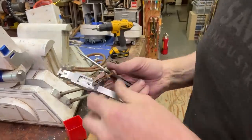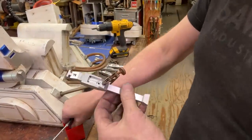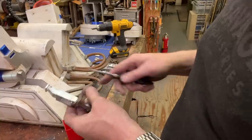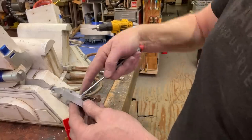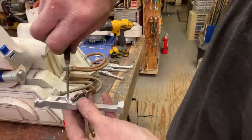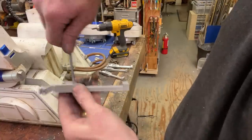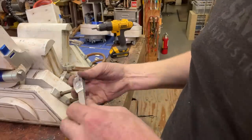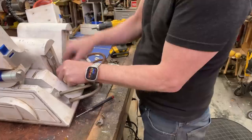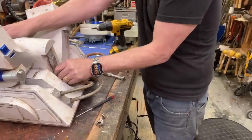Last one, I'm just gonna show you what I'm doing here. So I clamped this in place to the right height. Then I drilled a through hole for a tap, 6-32 tap. Then without removing the clamp, I simply countersunk it and tapped through it. And that allows me really nice orientation. Plus I countersunk it so it goes below the surface. And now these two parts are nice and solid. Good. Beauty, truth and beauty. Very happy.